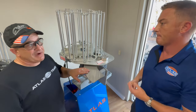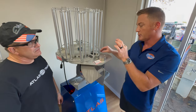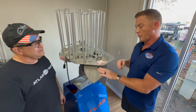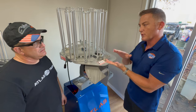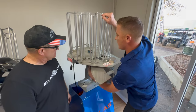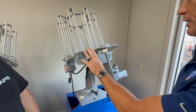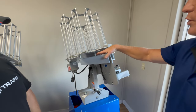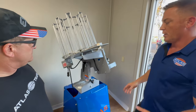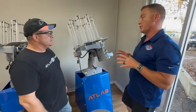You see a lot of that with bows as well. Also, where the target drops down, we've got a 24-gauge 304 stainless steel plate that it lands on, and there's a launch plate underneath that's cut out, so it's really gentle on the target. Our throwing arm is T6 aircraft grade aluminum. The launch plate's 304, the knives are 304, our target finger is stainless, and our spring on the back that feeds the magazine is stainless. We've used stainless and aluminum in all areas we don't ever want to corrode.